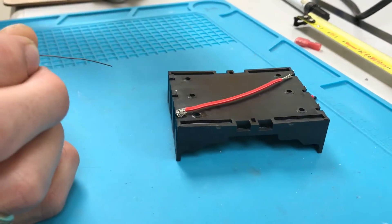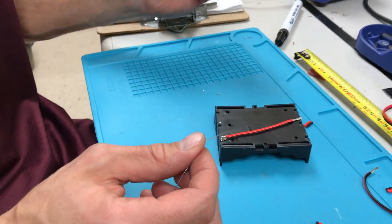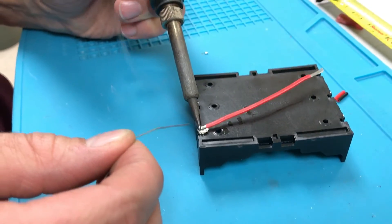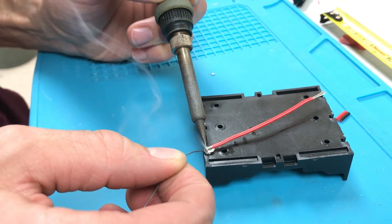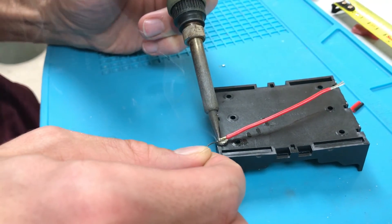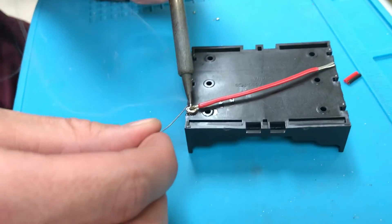My iron's not heated — there might be a problem. Go ahead and heat up the joint and then feed the solder in after you've heated it up a little bit. If the solder doesn't flow, give it a few more seconds of heat and then try again. Then just flow quite a bit of solder in there so you don't have loose strands.